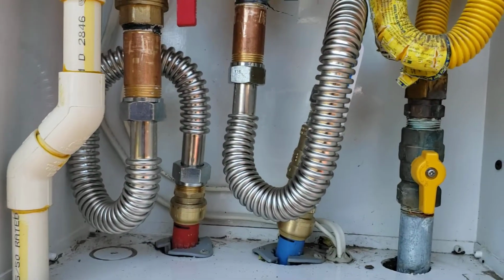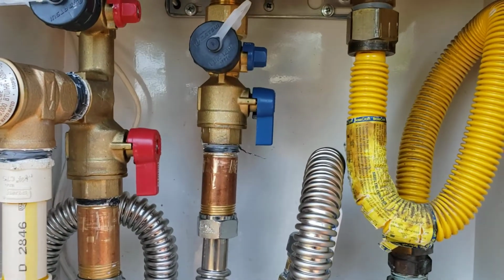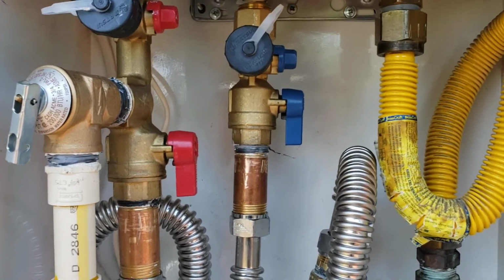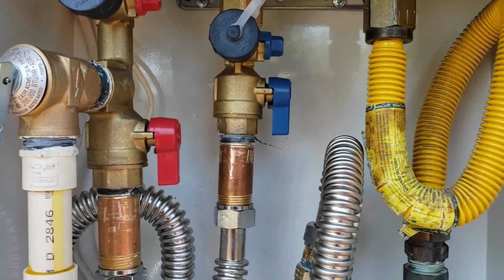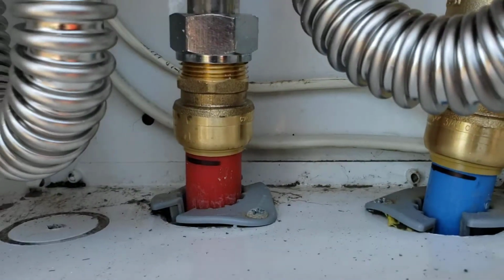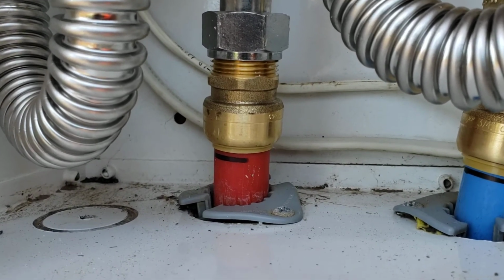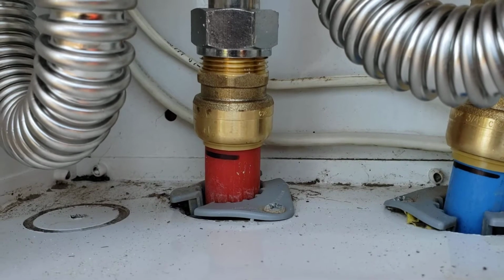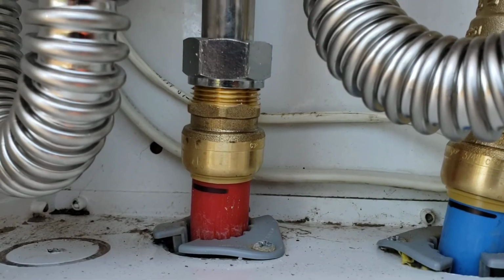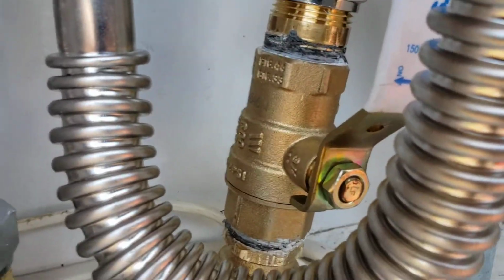Plus, the old valve, and the homeowner told me this, was the Webstone isolation valve kit that was in there, and it was real hard to operate and probably getting ready to break. We've tried to utilize those during flush and snapped off that handle, so it's just good to get them out of there. What we did, we let the homeowner know we'd like to get you a full shutoff valve. Now, these are SharkBite fittings down below. It's PEX coming through, and so these are UPC rated, which is Uniform Plumbing Code. So those are code, and it just adapts to the PEX and then gets us some threads. Same thing over here, adapts to the PEX, gets you some threads, and then one valve, cold water.